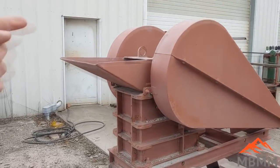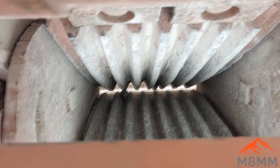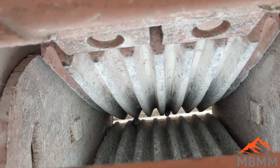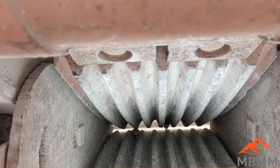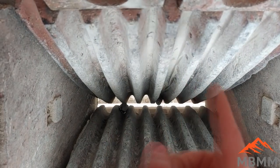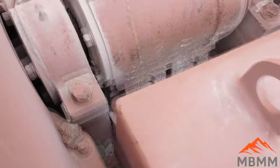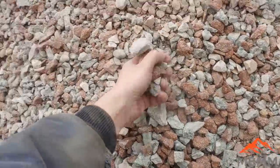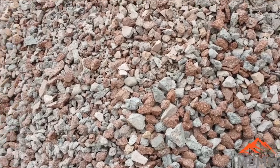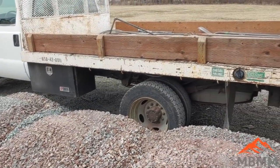Here's the crusher we used — it's got this big inlet tray that was really great for shoveling into. The material fed right down into the jaws. Looking down the jaws, they're still brand new — we didn't even barely scratch the paint. The way you measure these is tip to tip across the jaw is 6 inches, and the width is 10 inches — that's what I mean by different jaw crusher sizes. The 6x10 can crush quite a bit smaller than this output, but that's pretty good gravel and material for our driveway. We'll scoot it back onto the truck and spread it on the driveway.